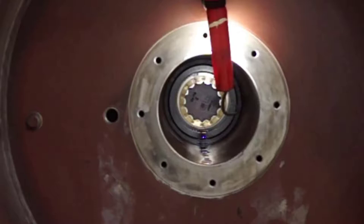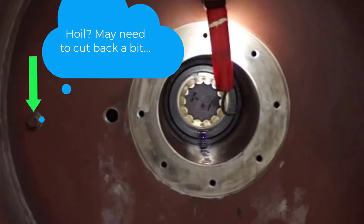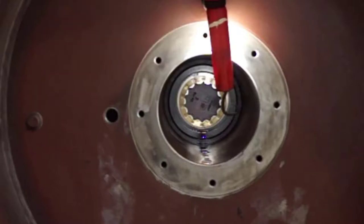The left hand side of the vibrator runs on the large roller bearing you see. The open hole you see is for filling with oil. The other hole provides access to the hollow drum to add calcium or diesel fuel for extra weight if desired.